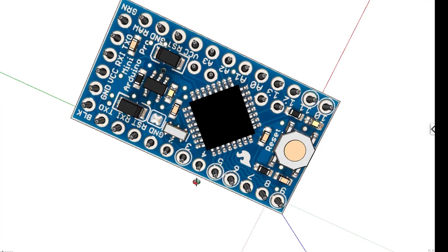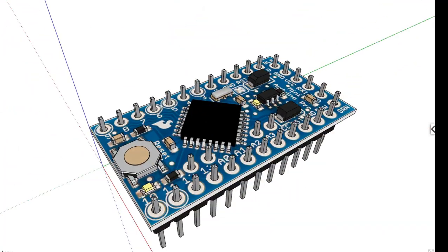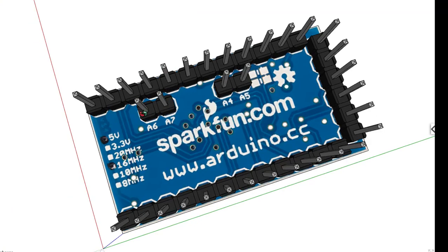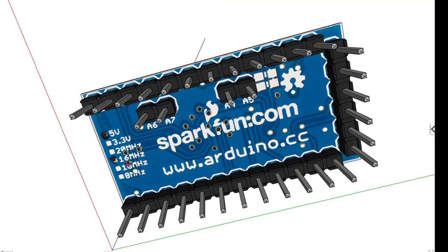But if you are sending data with a pin and then you want to accept data on that particular pin, you have to write that this is the input pin. Similarly, if the pin has been set to HIGH as an output, the pull-up resistor will be set when you switch it back to an input.